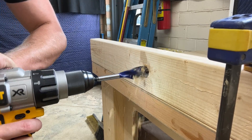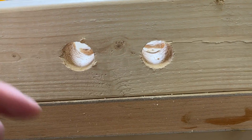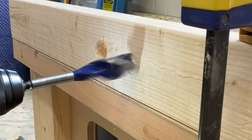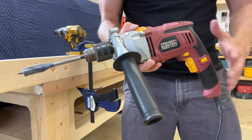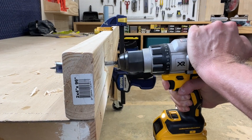For instance, the screw point is so aggressive that it can easily wander off path if you're not well aligned, so it can be really tricky to hit a dead-on exit mark. Also, this bit will physically drag you if you're not ready for it. The screw point is like a tractor pulling the bit and the drill with it — you hauling back on the handle won't do much, it just keeps going. This is especially problematic with corded drills because they don't have clutches or brakes. If you're up on a ladder, you need to leave enough slack in your position to let the drill travel, otherwise it can pull you right off your feet.